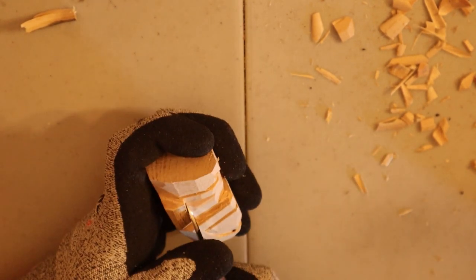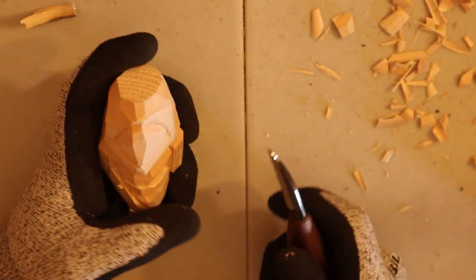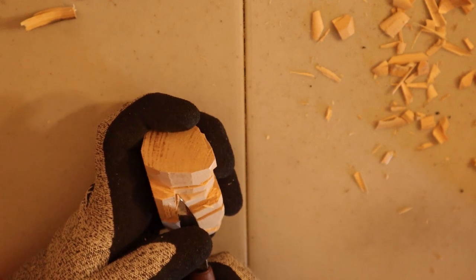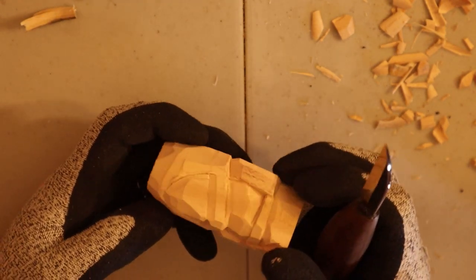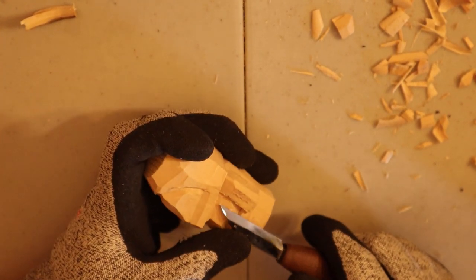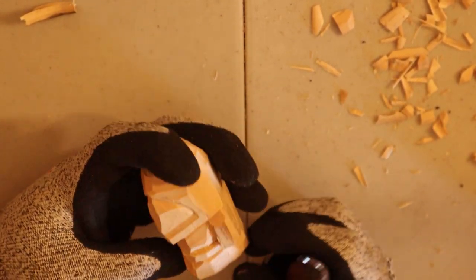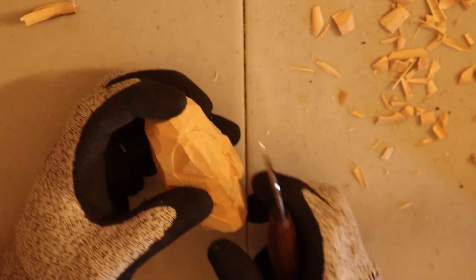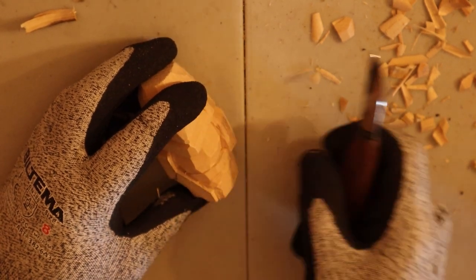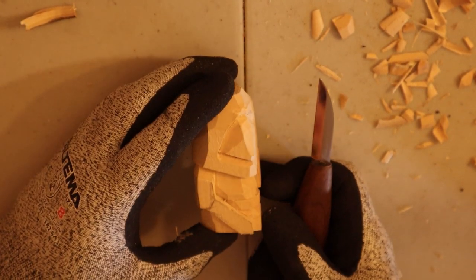And since we have the belt now, we'll do the same thing that we've done on the other side with the sword. So deep cut, and then we just remove that corner and I'll create more shadow. But I really made ugly cuts here, sadly. Well, so I said earlier, it's important to know the depth of the tip of your knife. I don't really like that part here. Just remove it a bit. Okay, there we go. So all that wood in the front here is kind of ugly, so we'll remove that, but we need to keep the sword in mind. So just to make the blade really triangular, I'll remove that part here. Okay, so now the sword has a normal shape,